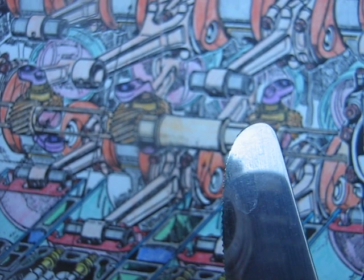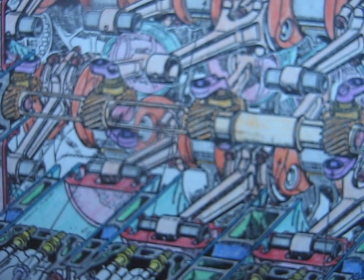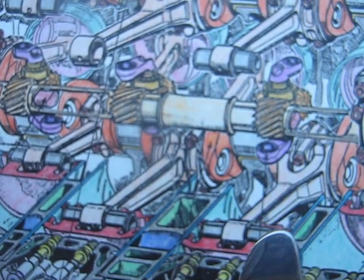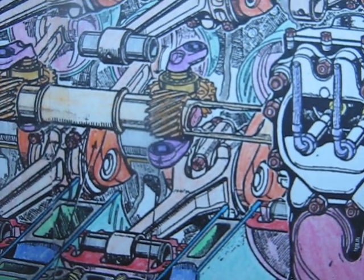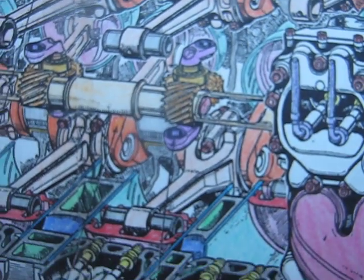We'll move on to the Napier Sabre here. It's a four-stroke engine. As you can see here, you've got this common sleeve drive that runs from front to back — there's two of them, one on each side. And you can see these gears here and these little shafts that come out from them. That's what drives the sleeve — the sleeve drive crankshaft. It's got these 90-degree gearing changes that do it.